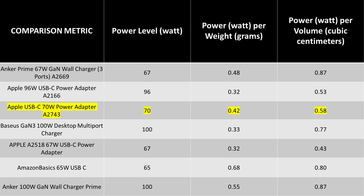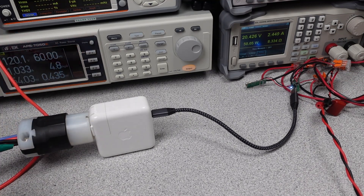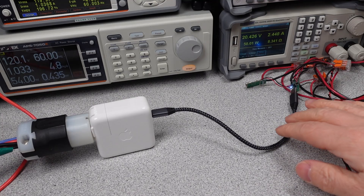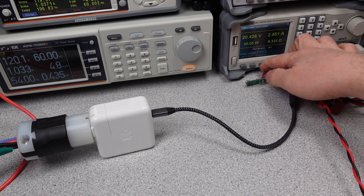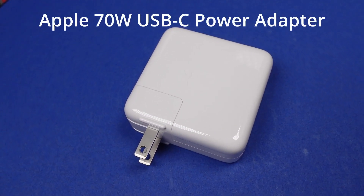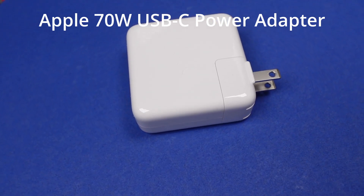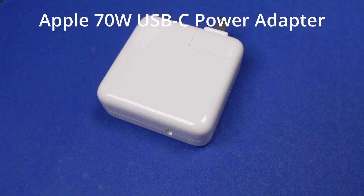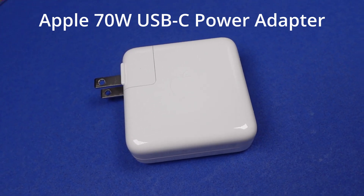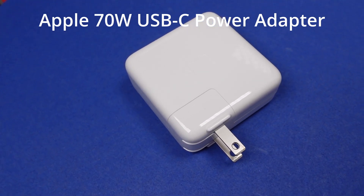Apple isn't winning an award for value or size here, but it looks like they are trying — this adapter went on a diet both size and weight-wise versus the previous edition while gaining some power. What I think they are trying to do is sell you an adapter that works well with their products and hopefully will last a long time. My theory is that by overdoing the capacitance values a bit, an argument can be made for extra safety factor, so that as this value falls over time, the adapter will still work. Overall, this adapter is an excellent pairing for the devices it powers. It exceeds the standardized requirements and achieves real positives like low idle power consumption and high power efficiency. This is a worthy replacement to the 67-watt adapter, and it makes sense.